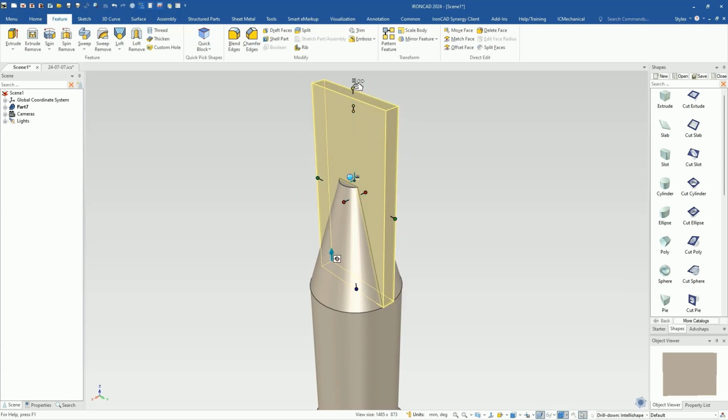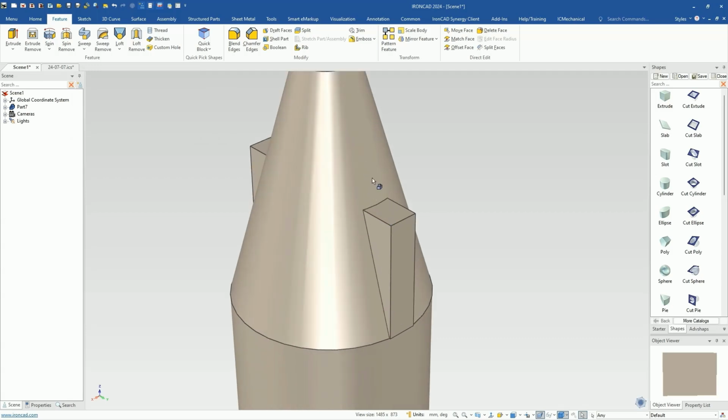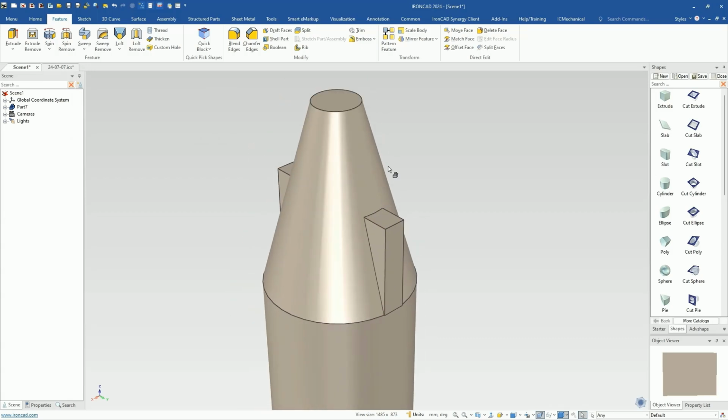In this case, this value here is 20 millimeters. If you look at the dimensions on the drawing, it's 133 to 153, so it's 20 millimeters high. So we can just go ahead and double click that and set that to 20 to get that in place. Next, we need to do a rib here, because we're going to get this next shape here.